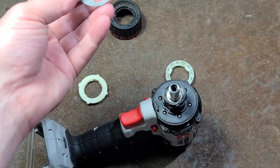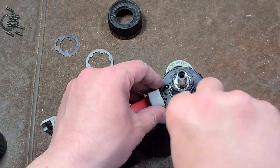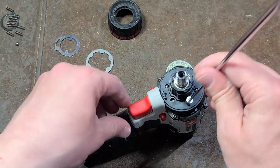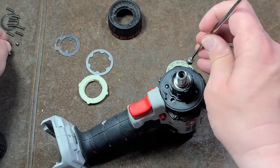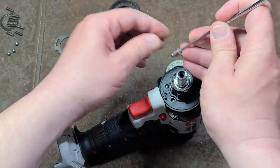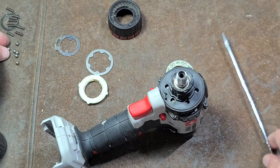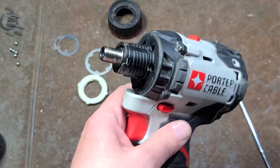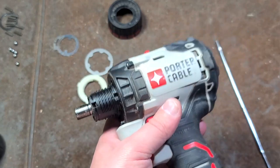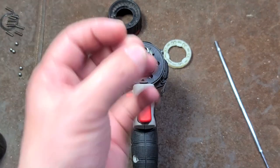There's our ball bearings — we'll nab those out of here and keep those too. They're handy; you never know when you might lose a ball bearing from something. If you build up a little collection of bearings from stuff — bicycle hubs, wherever you find them — you'll end up having a size that you need, since there just aren't so many sizes of bearing balls. A ball bearing is an assembly; a bearing ball is just one little sphere.